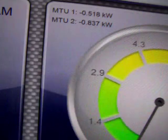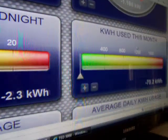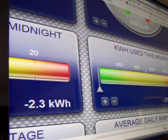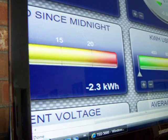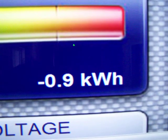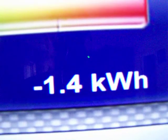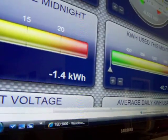It's real overcast out there today. Let's see what we've made for the day so far. It's 11:51 now, so we've made 2.3 kilowatts today. MTU1, which is the Sun G's, has made 0.9 kilowatts — so almost a kilowatt. MTU2, which is the Enphase, has made 1.4 kilowatts. And they both have 1,800 watts fed into them. So that's the results.